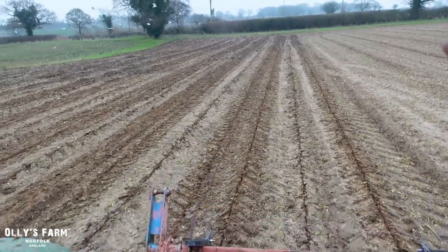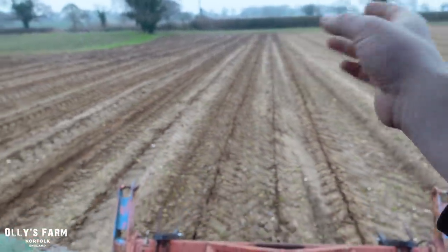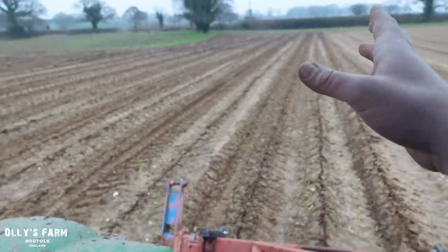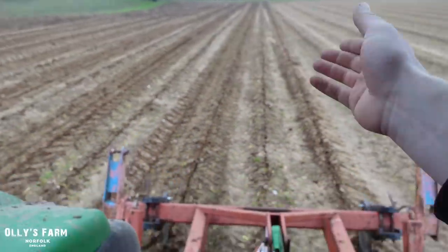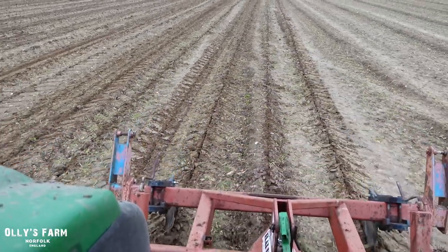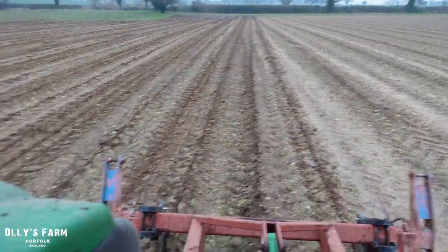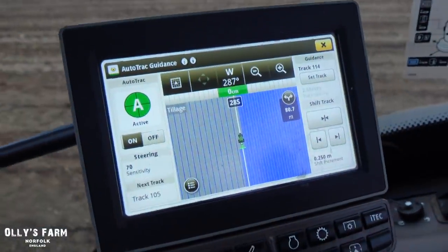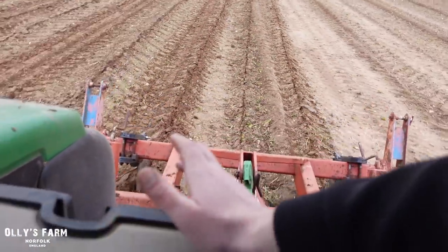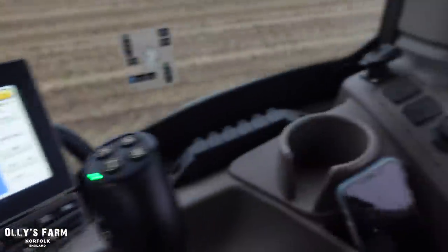So even though we are making a mess a little bit on the ends, they'll dry up quicker now - certainly within the next few weeks. I'll come back and have a look with the buggy at all of this, and it'll just keep drying up. That means I'll be able to come in later on in springtime with the Pottinger and just level those bits out and tidy it up. They'll be bone dry because we've been through the subsoiler now. So we are doing a good job, even though it looks like we've made a little bit of a mess in places. As you can see, I picked my AB lines earlier on this morning and I'm using the GPS which is Green Star - that's just with the SF3. It's just the basic GPS you get with John Deere - we don't pay the subscription. It's pretty accurate, within around three to four centimetres, which is plenty for what we need.